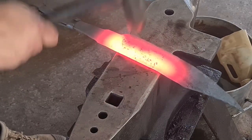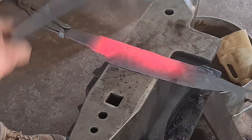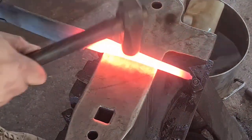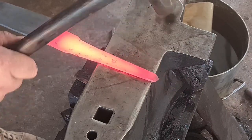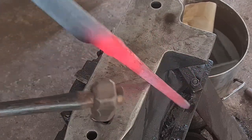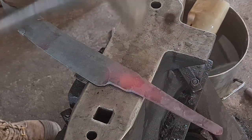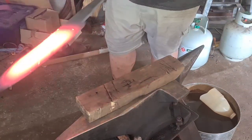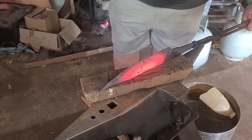I'm forging a little bit colder than normal, but I'm actually forging quite gently, planishing at a very low heat to get those final little details out — blasting the scale off and planishing the material so it's nice and smooth before we finally finish. At this heat and with this technique, I'm refining my plunge line and also refining the grind line. The grind height of this knife is about two-thirds of the way up the blade, because the spine has to be relatively square to take the sparring bar it was going to have. You want a really neutral fire and to work at a relatively low heat to prevent scale buildup. I noticed at the end that the curve wasn't quite what I wanted — it was a little too curved in the spine area — so I took it back to a wooden block to avoid upsetting the shoulder between the tip and the spine.